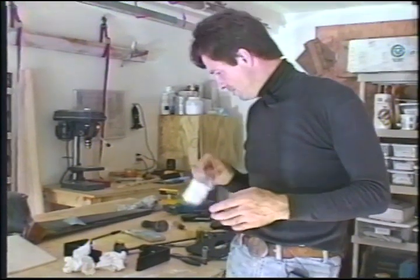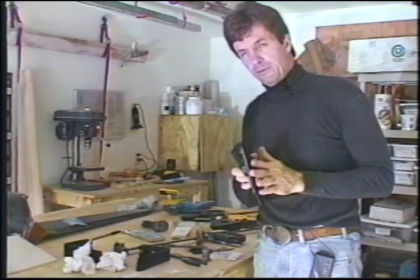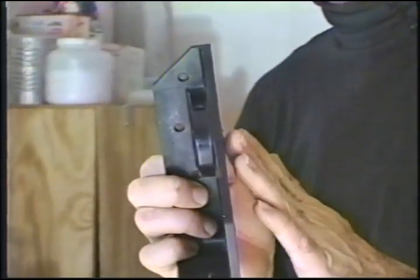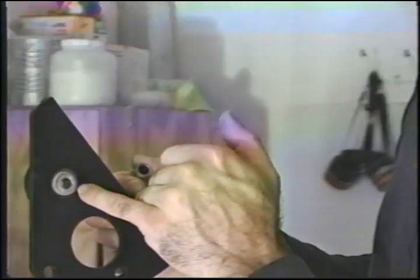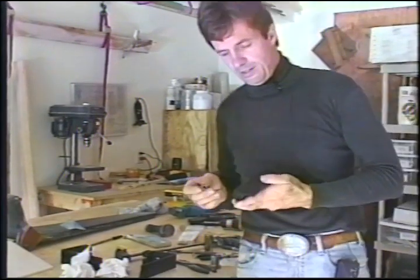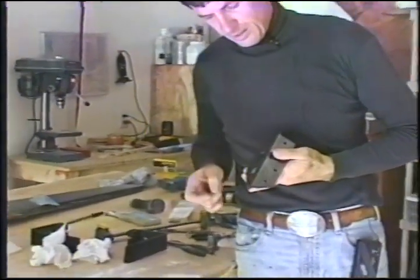Okay, I've got 3 of the remaining 4 bushings here. This one's already in place. You can see it sticking just through. It flushes this out so that when you go to put your gear leg in, it's sitting on top of the bushing and not the race for the bearing, which is well inside. That's verboten. So here's the way it's supposed to go.